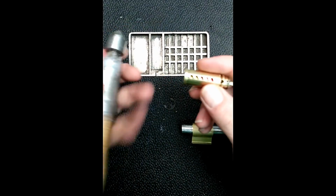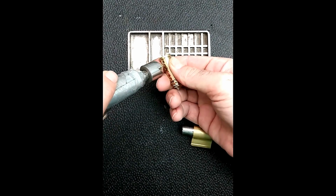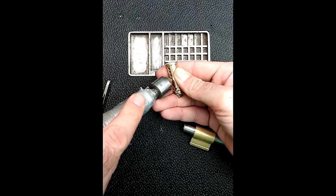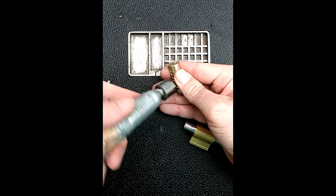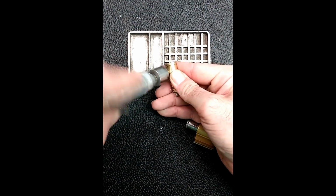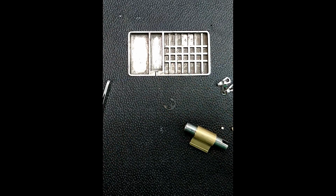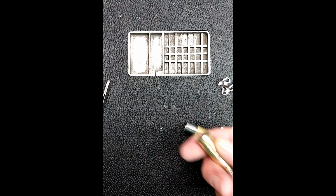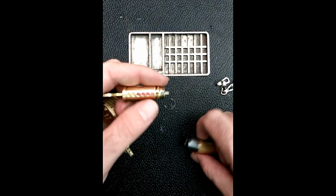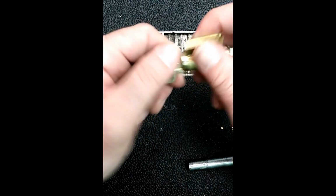By countersinking bit, just referring to this, it's usually easier when you don't have your pins in there. All you do is just put a nice little bevel on it. Alright, so we find our key again, put it back in there, knock all the brass bushings out. Oop, that's the wrong side. Now the key works smooth as can be.